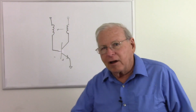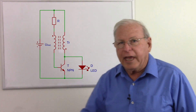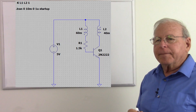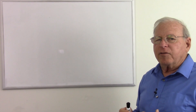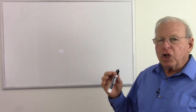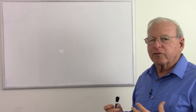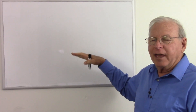There are a number of different ways to make a blocking oscillator. Here is a Joule Thief from the Wikipedia article, and here's another circuit which I modified into the one we already talked about, and here's yet another version. They all have one thing in common: a transformer going from either the collector or emitter circuit back to the base circuit, but no tuned element in either of those inductors. So we don't have an Armstrong oscillator but a blocking oscillator, which works because of the collapsing magnetic fields reverse-biasing the transistor, thus blocking current and causing everything to collapse and then rebuild.